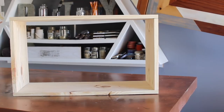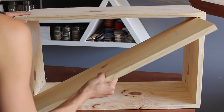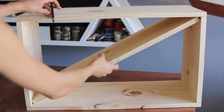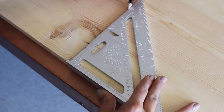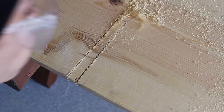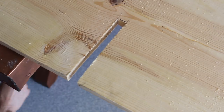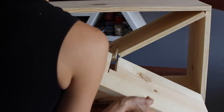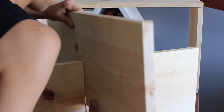Once that was all put together, my original idea was to cut two pieces of wood to go diagonally creating an X to also create shelves for wine bottles. I didn't miter down the edges because I always mess that up, but I made a mark down the center and used my jigsaw to cut it out and my chisel to pop that piece of wood out. I thought if I did that on both pieces of the X they would shimmy together perfectly, but that only works for a square — not a rectangle. Lesson learned.